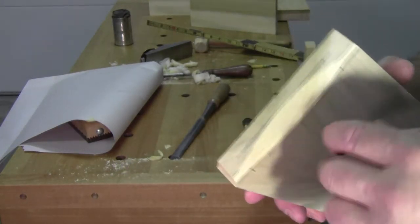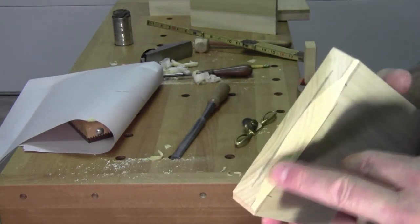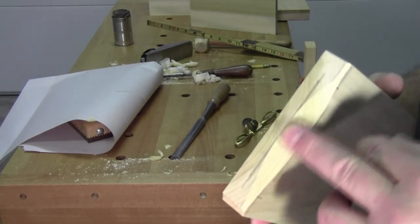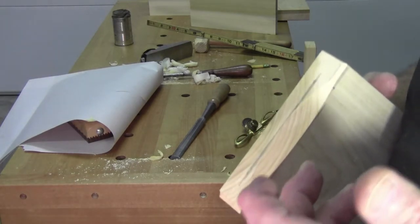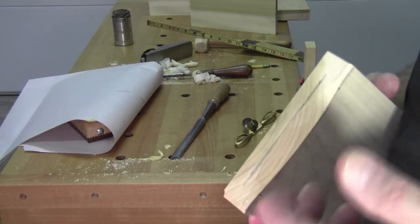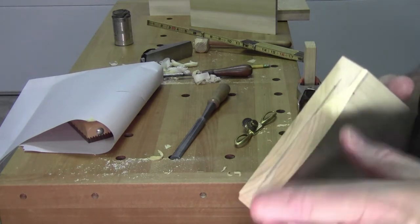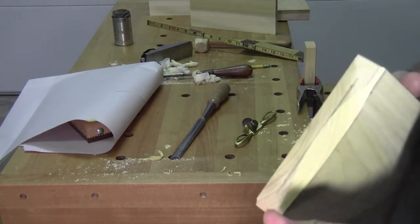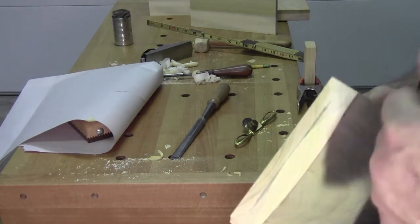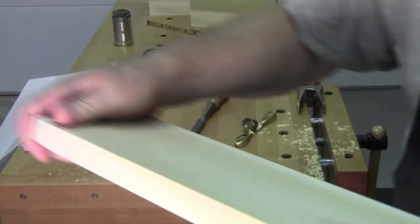And from this point, because this is end grain, you may want to take some probably 180 sandpaper, and then 220 around, you can put it around a water bottle. And just go in here back and forth a few times and smooth that out. But there's your finger grip. And you can make that any size.